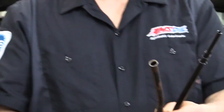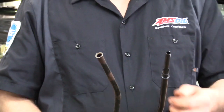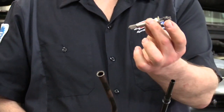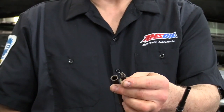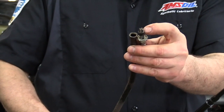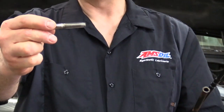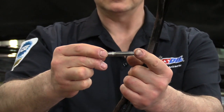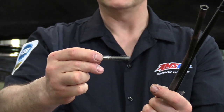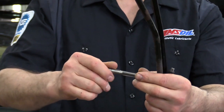Now we've got to figure out a way to get that piece out. What I've done so far — to be able to get that out without removing a lot of stuff — this is what I did. This piece right here actually goes on, you can see it on this tap. What I use is a 3/8 coarse tap and it's a plug type tap. It's got a little taper to the end of it so it can kind of thread itself in.